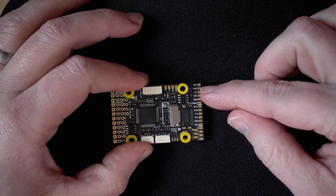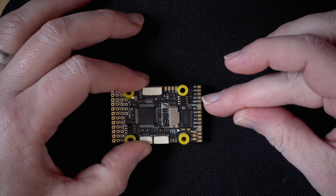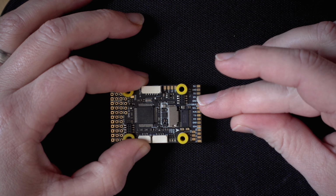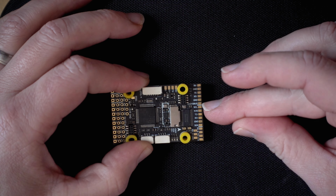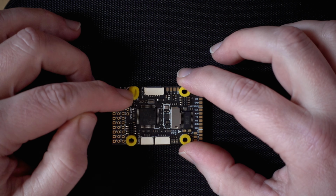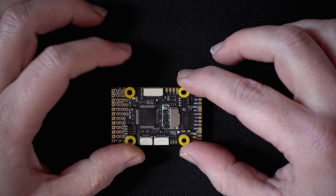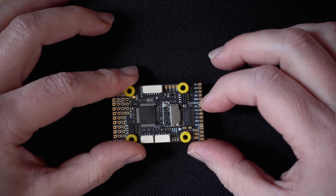So this here is the DJI section. We have 9 volts, ground, T5, R5 for UART5. So that screen printing is a little bit dodgy again there. Ground and S-bus. And S-bus is going to R2 for some reason, where down here I think it's going to R1, which would make sense because R1's here for the receiver. So we're using R2 just for S-bus on DJI.